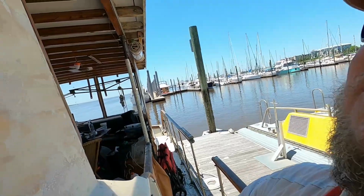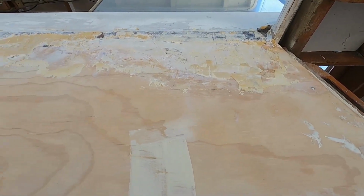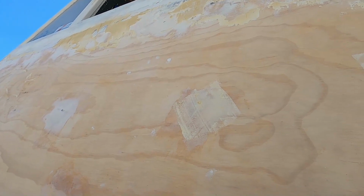Rats. In trying to speed things up yesterday, I really screwed up. I found this water-based powder putty that I was trying to use to plug some of these larger gaps, and it turns out it does great in holes, but this isn't a hole situation. I read into it last night on the internet, and it said it gets really hard, but any vibration snaps it, and there's a lot of vibration on this boat. So I came down here, and it just comes off like crazy. In trying to save myself some work, all I did was create work.